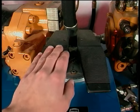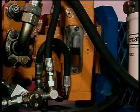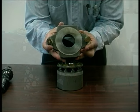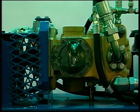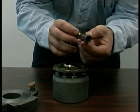When the operator presses the foot pedal, a hydraulic message is transmitted to the pump's internal controls. These controls set the angle, or stroke, of the pump's variable swash plate. The angle of the swash plate determines the displacement of the pump. Changing the swash plate angle alters the relative volumes of the pistons as the cylinder block rotates.